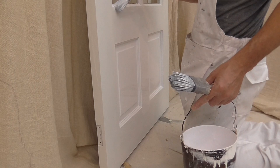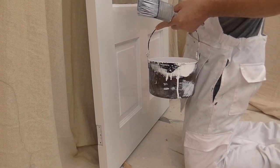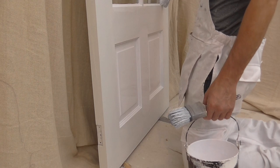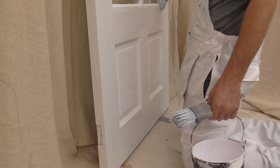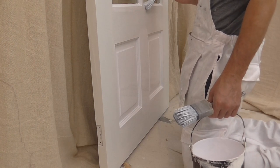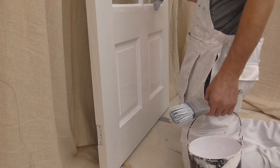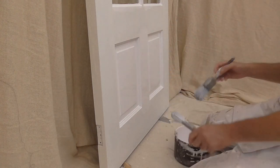I'd hate to try and do this with water-based paint, I really would. Again, I'm just trying to close up them brush marks across so it looks nice and solid. So you hear people saying, I put about 6 coats of paint on and it still doesn't look right. And that's because every coat they've put on, they've not evened it out enough and shut up the brush marks and made it look nice and solid. And that's where being a professional painter counts, because you understand that.